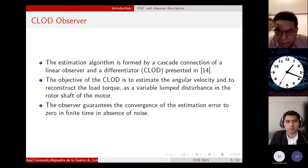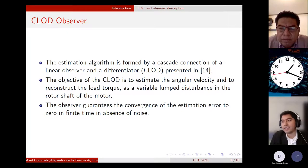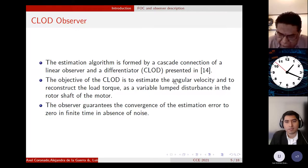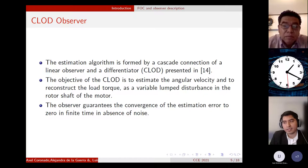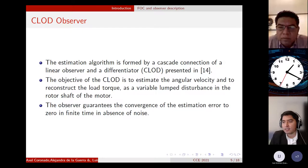Question: Is your ADRC observer linear or nonlinear? Answer: It is a nonlinear observer — a combination of two observers. It is a linear observer in cascade with a nonlinear observer. For example, the linear extended state observer is comparable to an ADRC observer. The nonlinear observer is more complex to implement, yes. But we have better results with the combination of the linear and nonlinear observer in cascade.